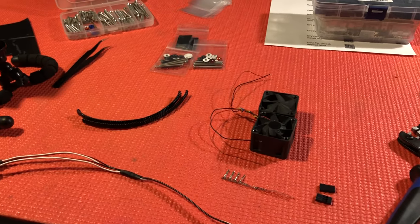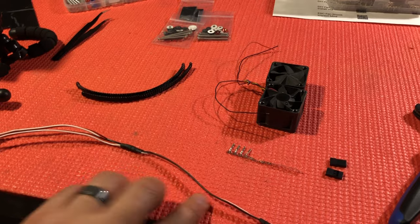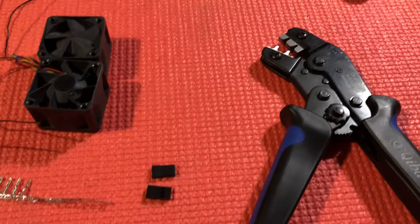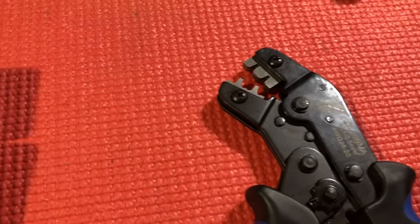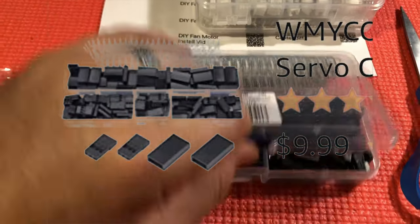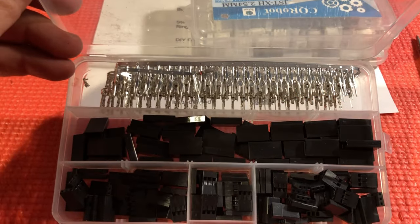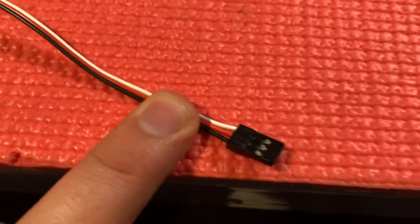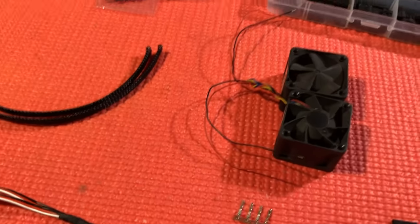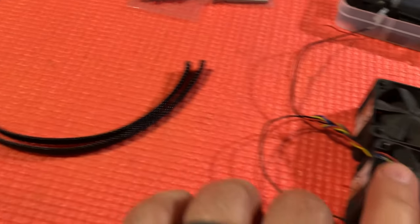The playlist mostly showcases just snipping wires and soldering them together, and soldering is fine too. But because I do this quite a bit, I figured why not learn how to use one of these crimping tools. You pick up your classic JST female and male connectors — there's a whole bunch of them — and then there are two versions of the metal terminals you'll need. This is more of a solder-free method of putting these things together.